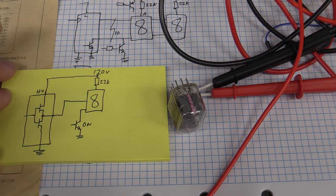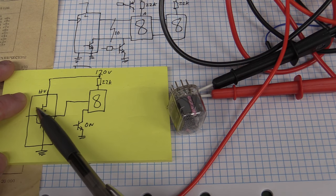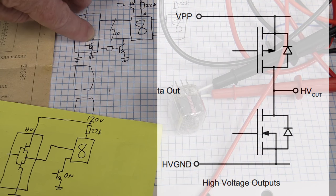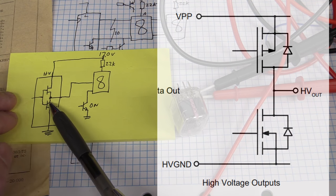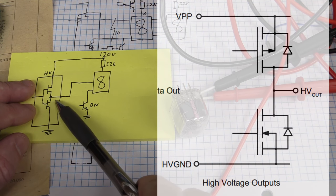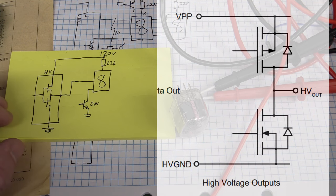Now the other issue that I didn't really cover in the previous video: I looked at some of the Microchip serial driver chips, and some of them looked fairly ideal, except they had totem pole outputs. A totem pole output is an output that, instead of just having an open collector like this one, i.e. the collector pin is just open, not connected to anything else inside the chip, inside here these are not open collector outputs. They're what's called a totem pole because they've got one top and bottom. They look like an old Indian totem pole. Anyway, something like that. It means that it's got a transistor which actively drives low and a transistor which actively pulls it high as well. So it's often called a push-pull output driver, totem pole, whatever.